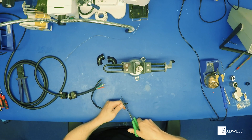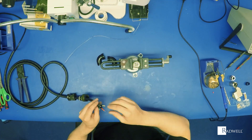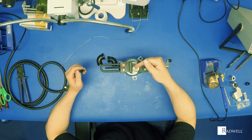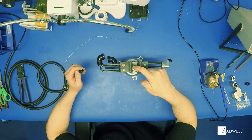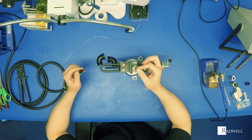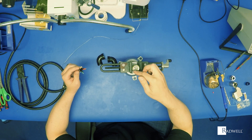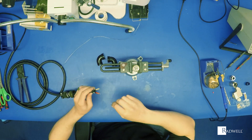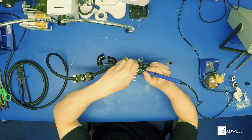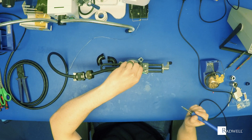I'm going to cut a little bit of heat shrink for each wire. The next tip: depending on which way your solder cups are facing — they are facing me right now — I always like to start at the back left corner. Because I'm right-handed, that's the best one to start with. If you start with the front ones, they'll be in the way for the back ones. Once the solder melts, you can slip the wire into place, hold it there, and let it set.